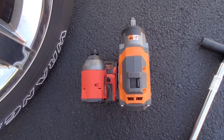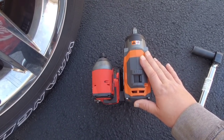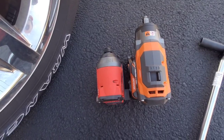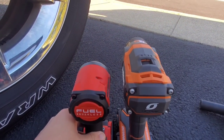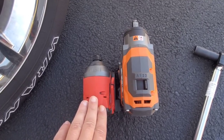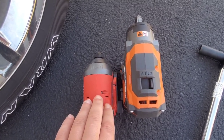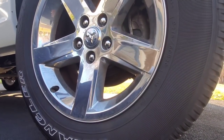Real quick, I just want to show you a size comparison of these two. This is the Rigid Octane mid-torque impact wrench. Now obviously this is not an apples-to-apples comparison, but really just to show you how compact this little Milwaukee is. They both have a three on them — both have three amp-hour batteries on them. We've seen this have no problem going up to 160 foot-pounds. That's probably going to be about the max because of that IPM — it's just going to start snapping socket adapters. So we're going to go to 150 on a 22 millimeter and see how she does. Might snap, but we're going to check it out.